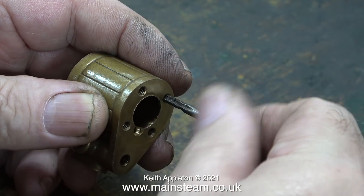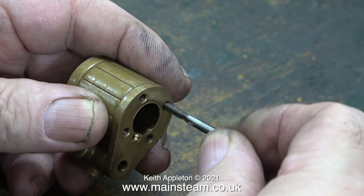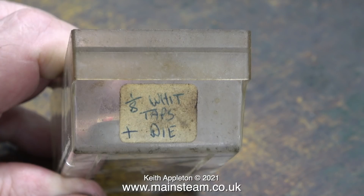This tap would appear to be a perfect size for the holes in the cylinders. To be honest I don't really know that much about the numerical thread data on various bolts, but what I do know is a 1/8th Whitworth tap fits in the holes, and in the same box of 1/8th Whitworth bits and pieces I also have some dies, so I will be able to make some new bolts for this. I was surprised to find out that they also have a 40 TPI thread — TPI of course stands for threads per inch.